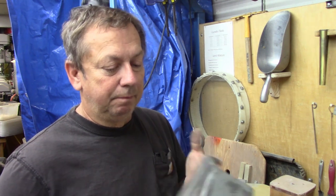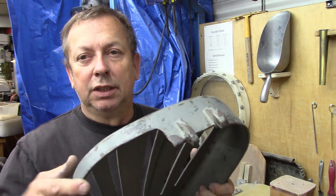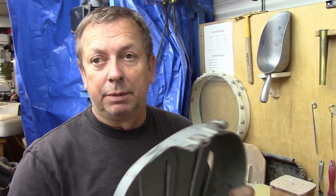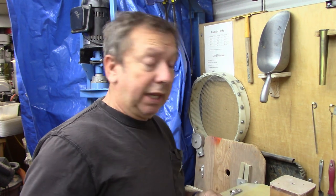When these were originally being produced in cast iron in a big foundry, their metal was always hot enough, they had the system down, their mold makers knew what they were doing. When you try and do these in a little shop like mine, you've got an awful big flask. I've got an odd side made up for this, but you've got to account for hinges that are cast in. Once you get a ram full of sand you've got about 130 to 140 pounds of sand in there - it's tough to handle for a little guy like me. I may reintroduce those in aluminum - they're tough to come by and people think they're worth big bucks.